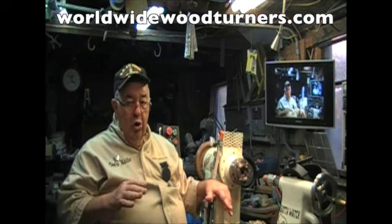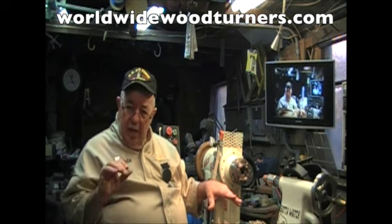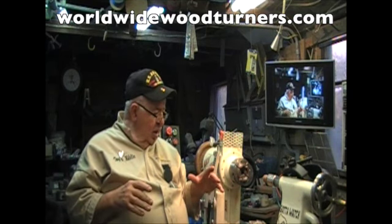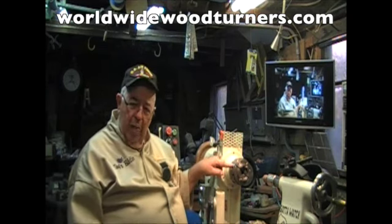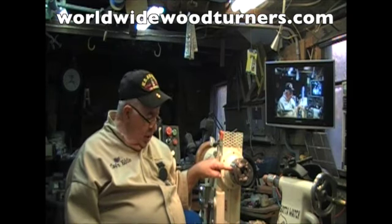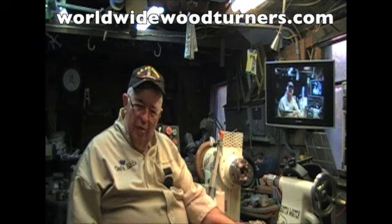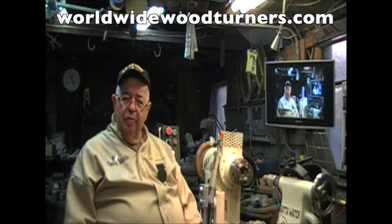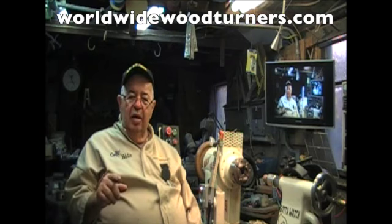And whatever you do, don't oil it, don't lube it, don't wax it, don't spray the WD crap on it, nothing. It's got to be clean. It's a steel-to-steel friction contact. All right? So let's see. We learned from my friend that we don't grab a Morse taper with our chuck. That if we have to grab something, we will grab a Morse taper with a shoulder, or a spur center, or a woodworm screw. And we can hold those in this chuck the right way when we start turning wood.